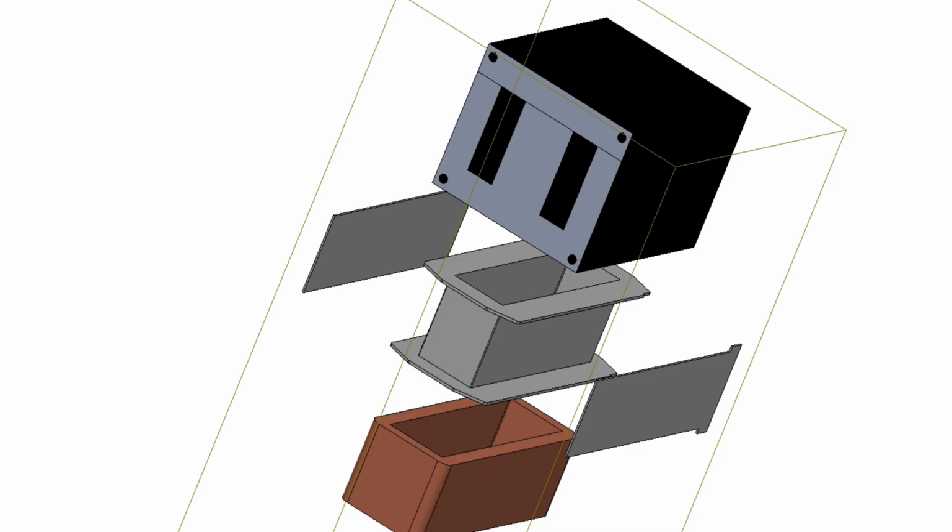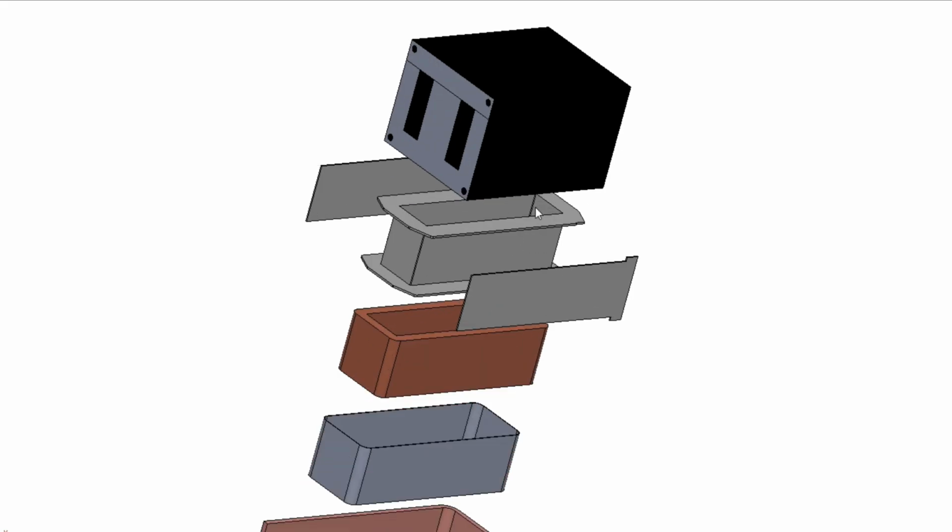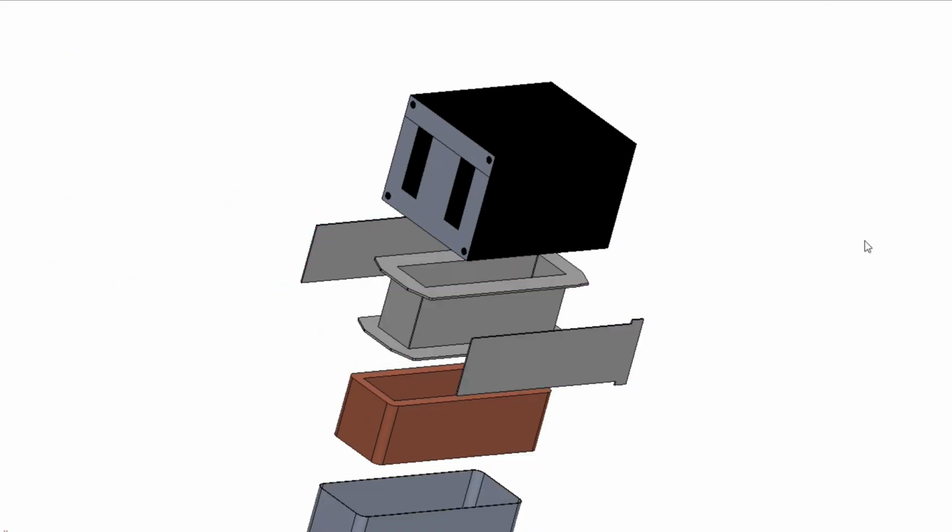The bobbins these days are mainly injection molded in plastic, but larger ones are often difficult to find and aren't manufactured at all. I made my own bobbin to suit a stack of 133mm long. Okay, so the exploded view here shows mainly the bobbin, primary winding, insulation tape, and the barrier between the primary winding and the secondary winding. The bobbin was custom made using two bobbins approximately 80mm long, which had to be cut, because 80mm is the maximum you can buy. So I made a custom bobbin for the E&I, a stack of 133mm. So 133mm from this face to this face on the inside.